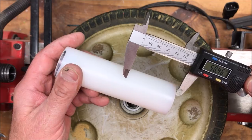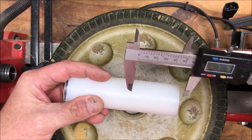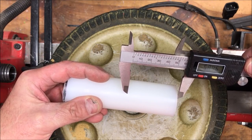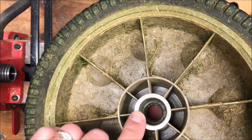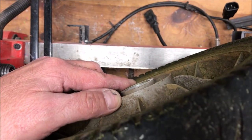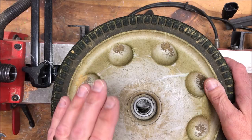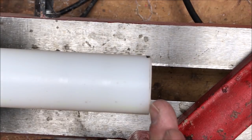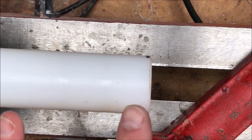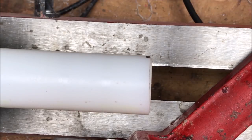I'm not going to bother cutting that off just yet because I'll use this back piece to hold this steady in the lathe, but that'll let me know how far back I want to turn my tenon. One thing I want to point out is there's kind of an indentation on this side of the hub — if you flip the hub over, the back side is all the way to the edge of the wheel, and that is the widest point. Setting it on the bed of the lathe and measuring from this lip should have given me the exact dimension we need. I've got the Delrin mounted in my chuck and it's running fairly true — I'm happy with that. First step is to go ahead and true the end of the blank up and then we'll start measuring back to the proper distance for the depth of that hub and start turning this down to the proper diameter.